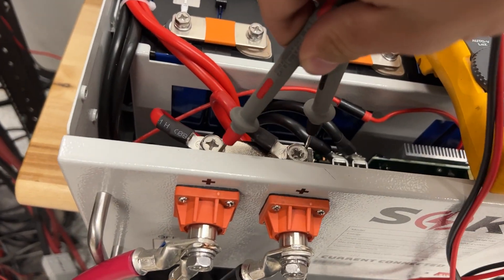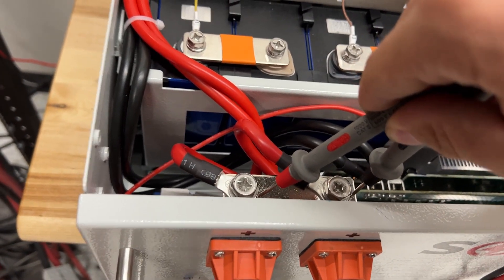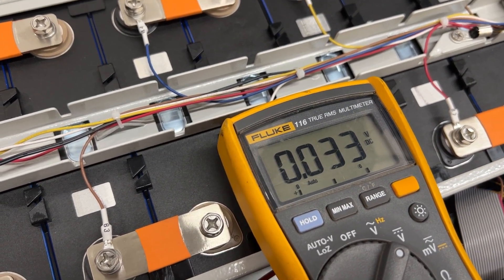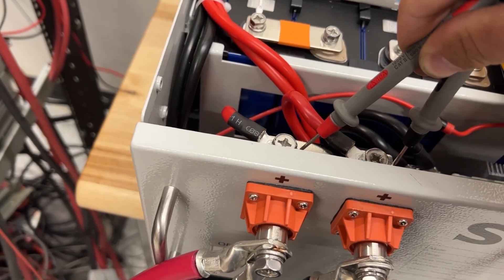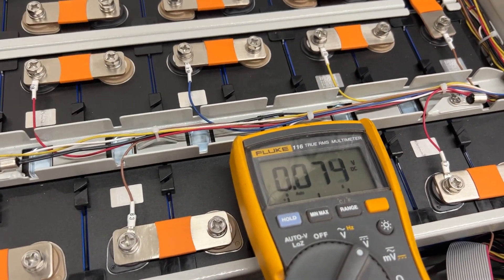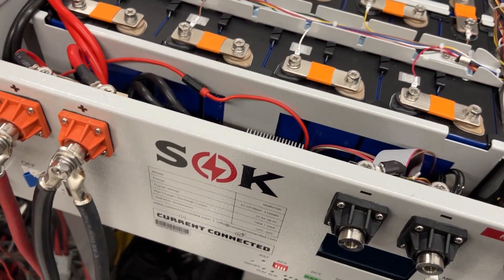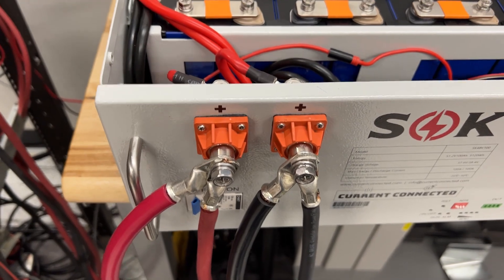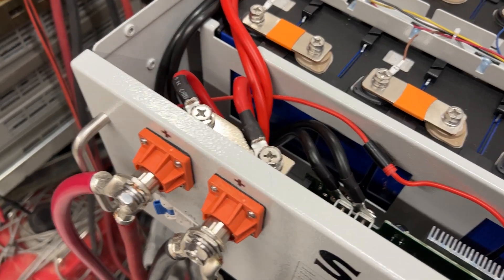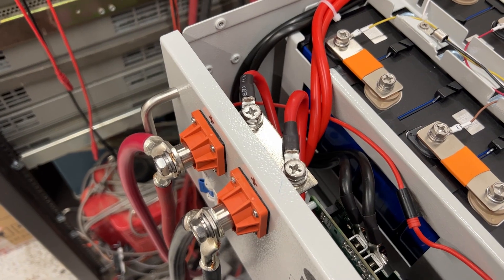Let's see what that equates to. I'm putting my Fluke 116 across here, trying to get a good connection to the bar. You can see there's about 33 millivolts drop. So yeah, 450 amps. Let me see across the metal here — we've got 75 millivolts. There's some heat coming out here, but again this is at a dead short. This is still 450 amps — you guys are smart, you can do the math. But the point of this was to make a cool video. Hope you guys enjoyed. We'll see you in the next one. Bye.